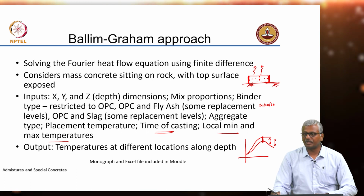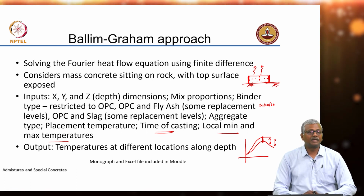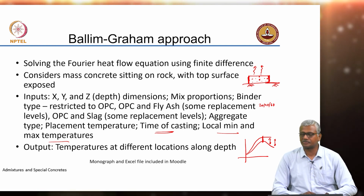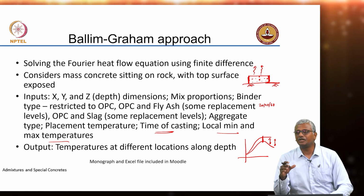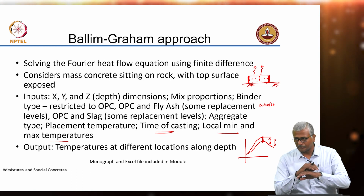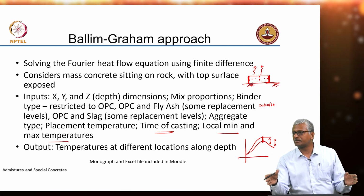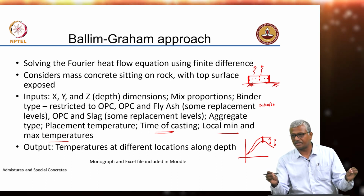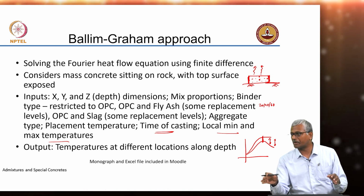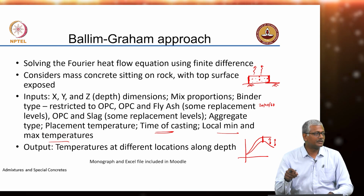In one more project, we had actually the use of plain concrete, and in this project, it was seen that there were cracks that were appearing in the structure after about 10 to 11 days of placement. There was no cracking until then. Top surface was insulated, side shuttering was done with plywood shutters, so the heat was retained quite well. Temperature was coming down quite slowly because of the plywood. But in spite of that, there was a differential created that led to cracking.